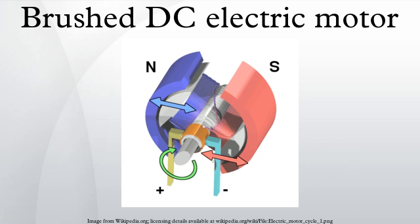However, the focused flux density cannot rise above the limited residual flux density of the permanent magnet, despite high coercivity, and like all electric machines, the flux density of magnetic core saturation is the design constraint.